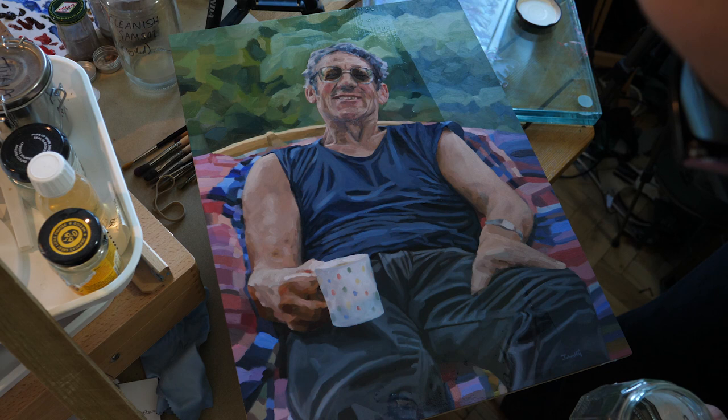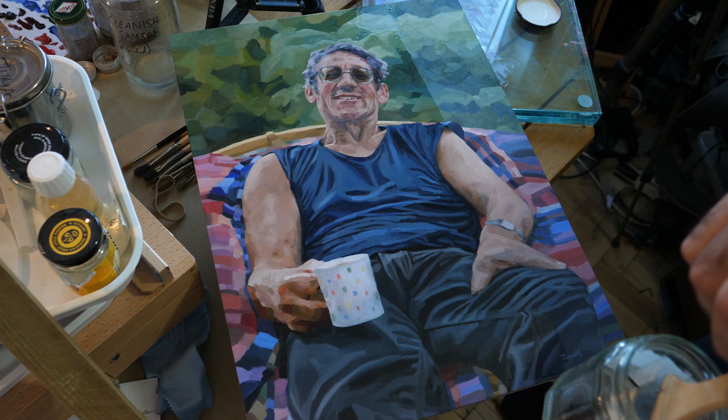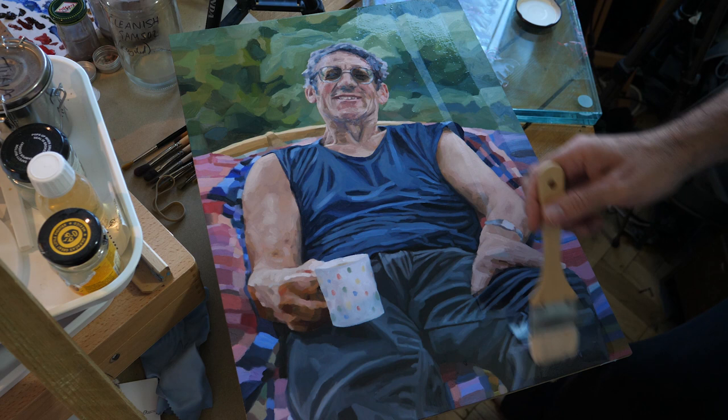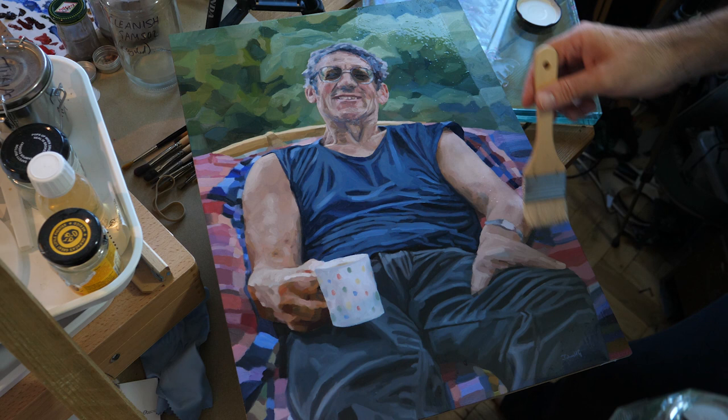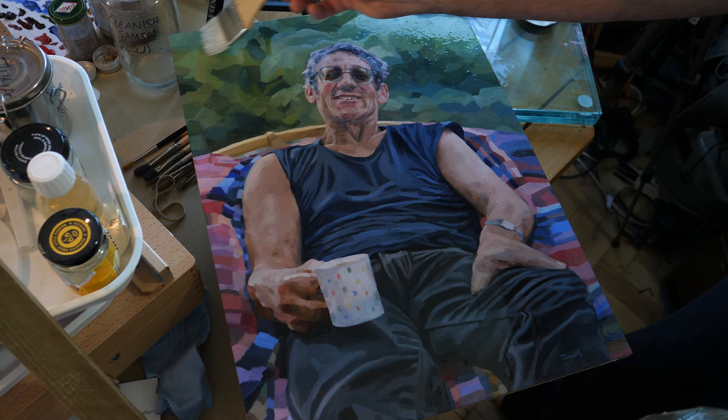Very quickly rub it off with a rag, and that will give an ultra-thin first layer of varnish. I'll see if I can show you where it's not stuck. I try to wipe the excess off the brush — try not to use too much. But you do want to go everywhere, so I do sideways as well, just to make sure you've covered everywhere.